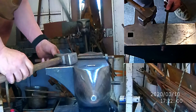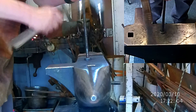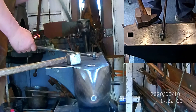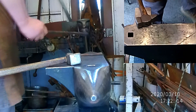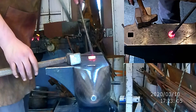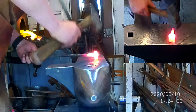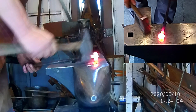Now what we want to do is take a fast heat — a very fast forge welding heat. So we're going to take our initial heat, then flux it, then weld it. Do not drop it in the fire and lose it, because now it's big enough it will slide right off. Set your initial weld, then weld it back and forth like so.